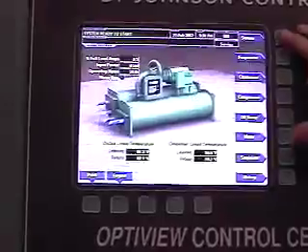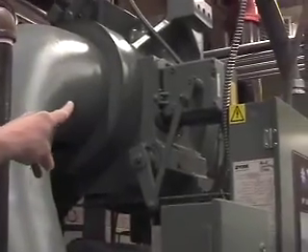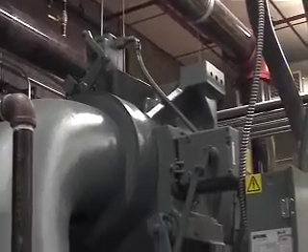Some other features: since it is a high-pressure centrifugal, in addition to the vane actuator which controls capacity, this machine also has a variable geometry diffuser, which limits noise and helps prevent a surge condition if the chiller runs outside normal operating parameters. The vane actuator motor drives your vanes, and a second actuator motor operates the variable geometry diffuser. That diffuser opens or closes the gap on the discharge side of the impeller to limit surging and noise.